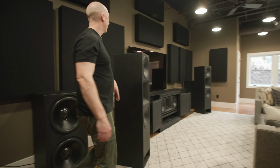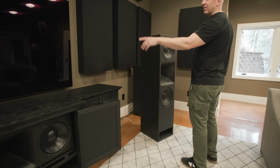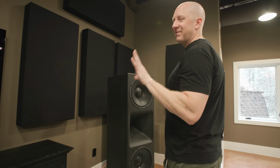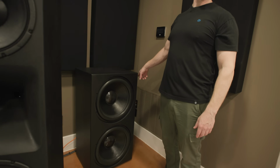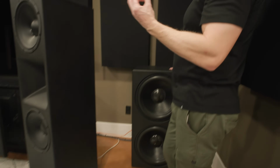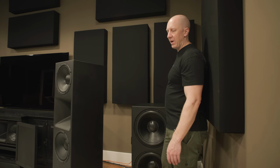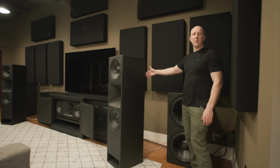And then this subwoofer over here, so the amplifiers, preamplifier, TV, Apple TV, those 5 things, and this subwoofer are on a new dedicated 20 amp that Mike put in, right? So the reason why we moved, and I've got this janky extension cord for now, we're going to make a new, bigger 10 gauge power cord, is we were getting a ground loop for some reason. I wasn't getting the loop on that subwoofer, but we were getting a hum through the speakers. When we came to our new dedicated 20 amp, it went away, and so we're going to run a big fat power cord to plug in our TV and then components.